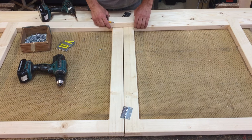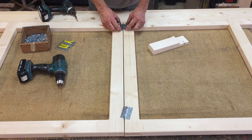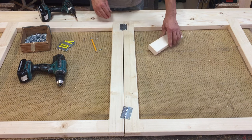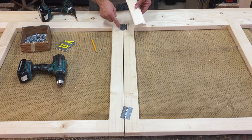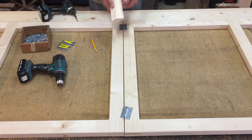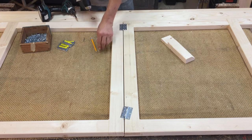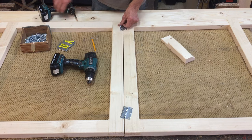I'll invest a little bit more effort and draw a line so this hole falls on that line and this hole falls somewhere in the joinery. Before I put screws in, if I bang three screws next to each other here on the edge I'm probably going to split it — it's softwood and it's got too much metal stuffed between all those fibers, it'll split like an axe. So I'm going to drill a little pilot hole — these are four millimeter diameter screws and this is a two and a half mil bit.